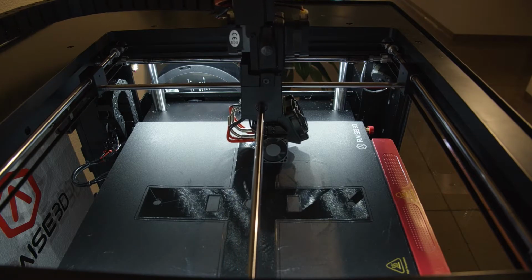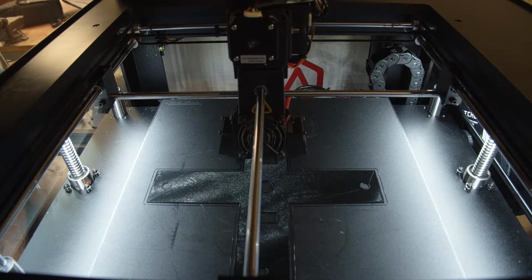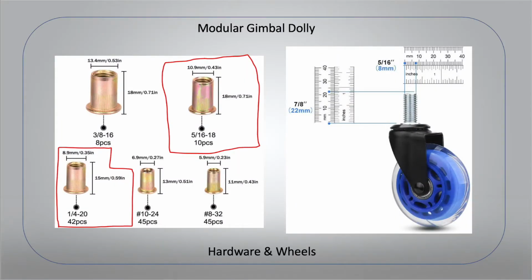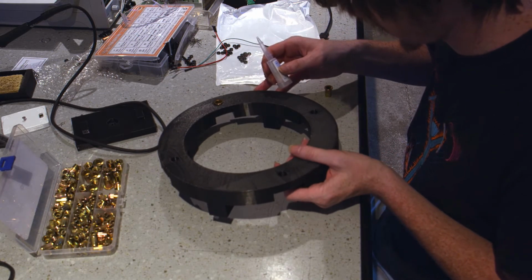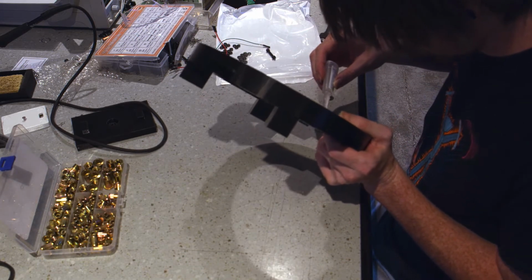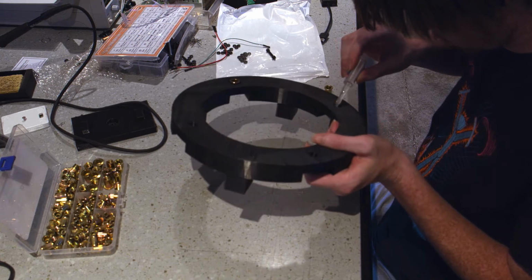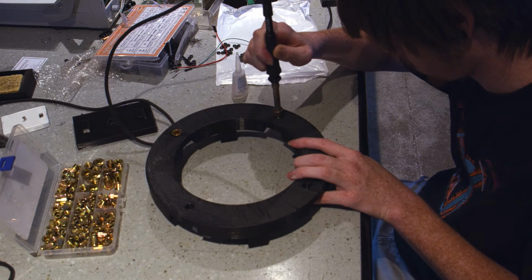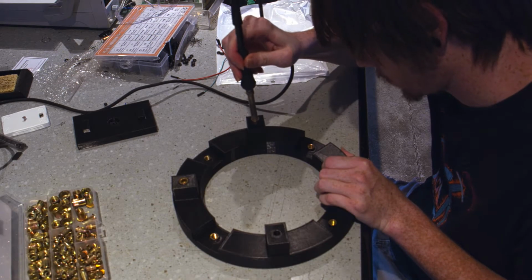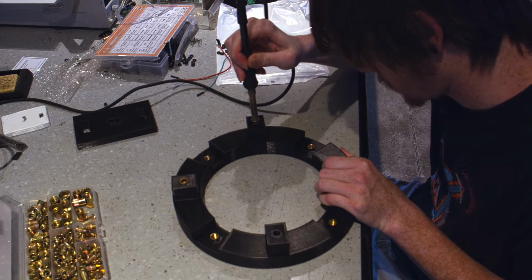After all of the parts were rendered, I took it to the 3D printer. After everything was 3D printed, I needed to add the inserts that you can see here on the left. At this point, I took super glue and the inserts, put them in each hole and heated them up a little bit so that they would slide in. Then the plastic cools around it and it holds it in nice and tight for all the pieces to screw together.